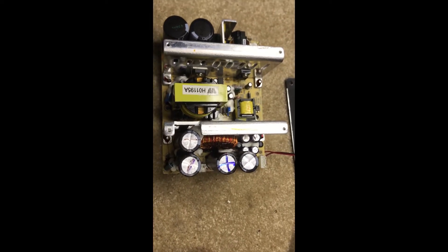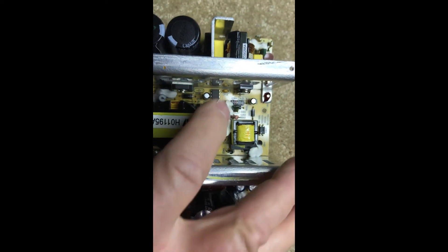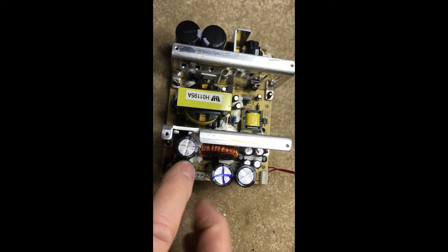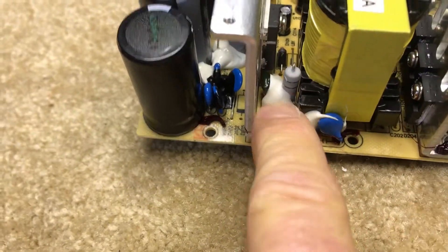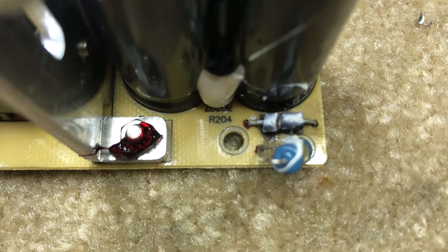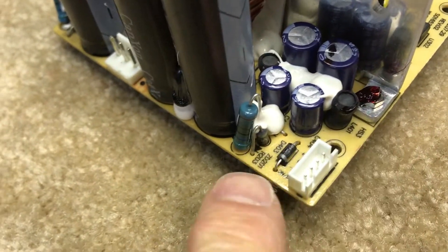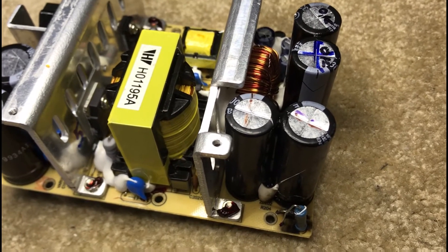We have the power supply on the bench. The least likely components to cause the problem would be the coils or transformers; the ICs and regulators would be suspect. But the most likely cause will be these electrolytic capacitors, so we're going to check the electrolytics first. Looking closer at the board — many components are covered with silicone — I noticed what looked like smoke from one side. I peeled back the silicone and found a Zener diode underneath that's cracked. Luckily this supply is set up in a mirrored positive/negative configuration, so the identical Zener on the other side can give me the part number for replacement.